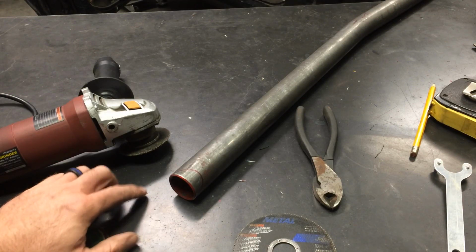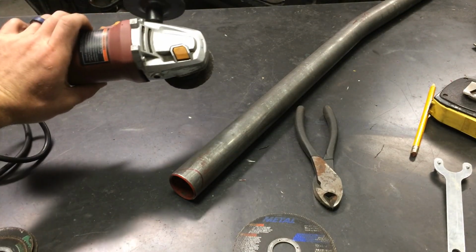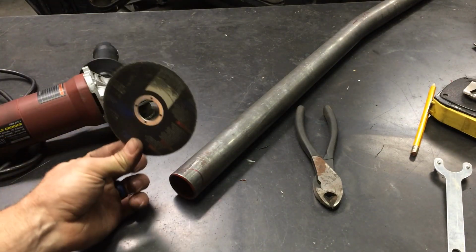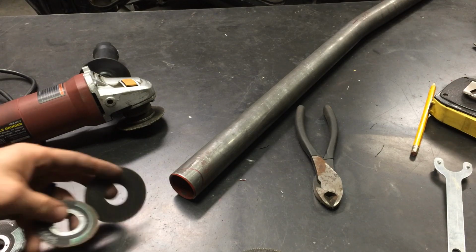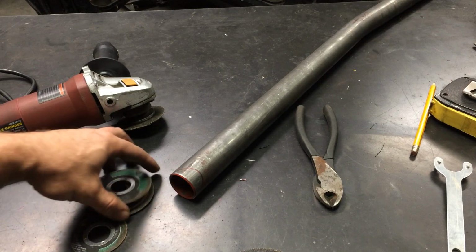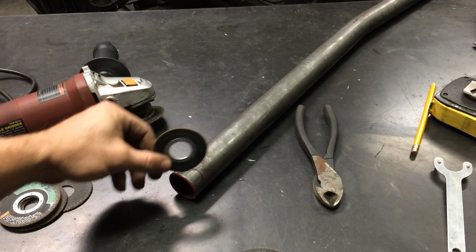So it's now time to notch my windshield bar. Before we do that, like I said, I don't have a fancy tube notcher. So I do prefer my small in size Harbor Freight angle grinder with a cutoff wheel. And the only thing I found is this: if you use a full-size new disc, it makes it very difficult to cut these contours. So what I've been doing and making a habit of doing is saving all of my leftover pieces. I didn't quite cut it for cutting big stuff. However, when you put it in here, it makes cutting these diameters or radiuses much easier.